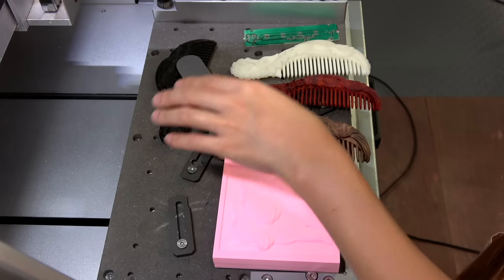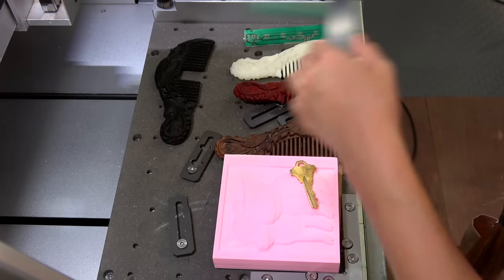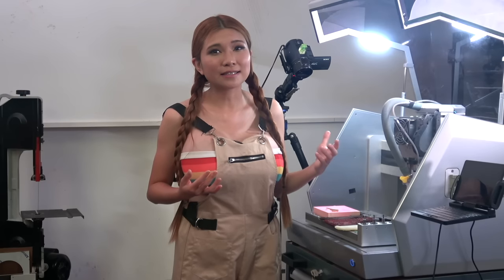For flat pieces of metal like this, I can get them done almost as easily as on the laser cutter or 3D printer. If I did them on my Syil, it would be at least an extra hour, although on the Syil, cutting steel is an option. Keep in mind the Carvera can handle light cuts in brass and aluminum, but steel is absolutely not going to happen.